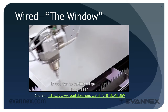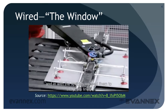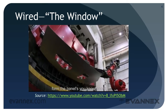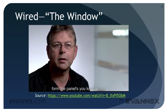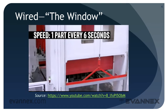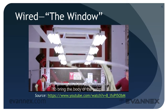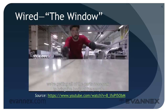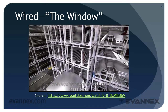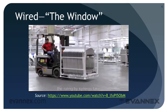In addition to traditional blanking tools, we're using laser. With these pieces, we feed them to the press lines — these gigantic dies. The press lines essentially form the panels. We are getting all of the parts necessary to make the body of the vehicle out of those gigantic machines. And then all of these parts, as they are finished, are brought to the body shop.